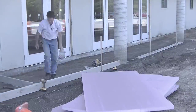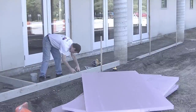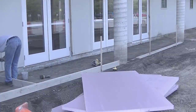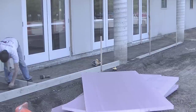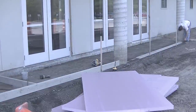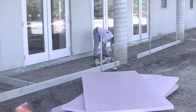The first thing I do is get my boards laid out. These people hired me just to come in and do the concrete walkway. The excavator guys did the gravel — they prepped the gravel and laid out a white line on the ground to give me something to go by. They told me the dimensions: five feet wide by about 30 feet long. That's what I'll be measuring my forms from when I measure off the building.